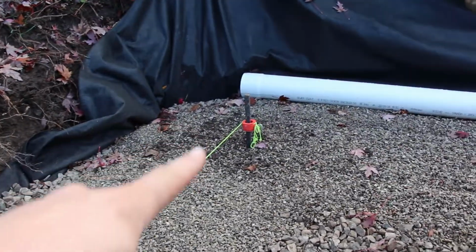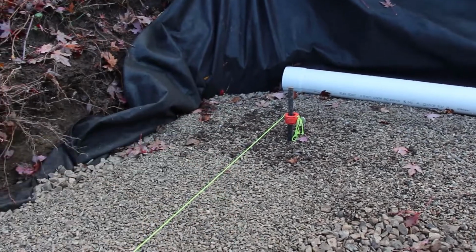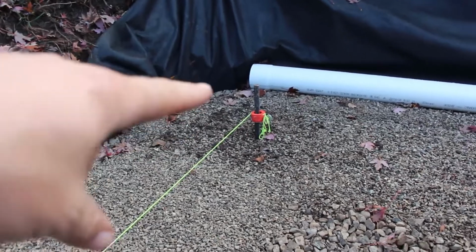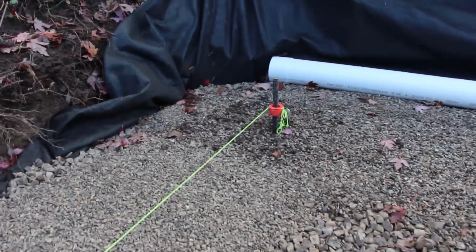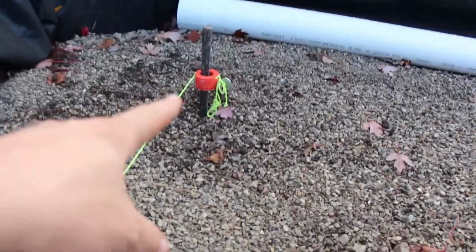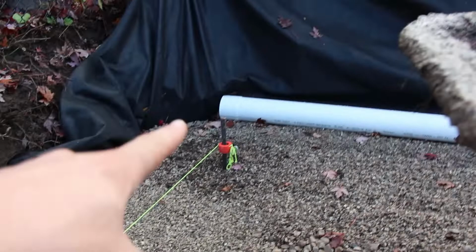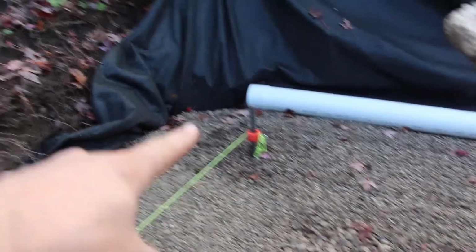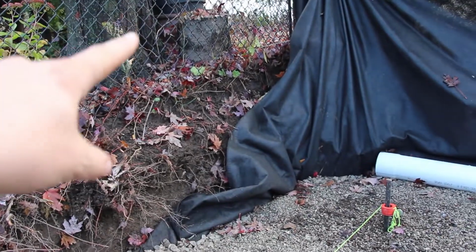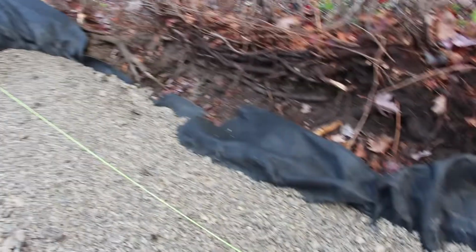We've got our collars on our string lines. These are awesome. I'm going to have a link in the description for them. I'm not a master of tying knots, so this just helps me tie my string line with those collars that go on pins nice and easily, tie from one end to another. And I've measured 30 inches from front of string line to the fence. On each side, that gives me a parallel line with the fence, which represents front of wall block.